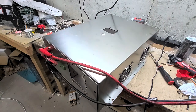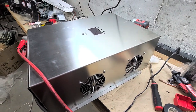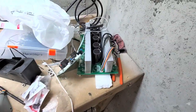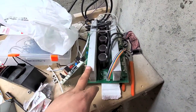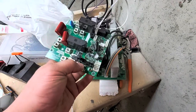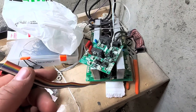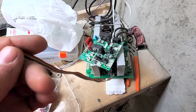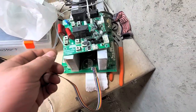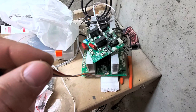My 12K is finally done. Again, this is a prototype, but it's finally done. As you guys know, I had to replace the main board. This is the original main board — there's something faulty with it, and we don't know if that's what caused the control board to fail. The new main board I installed is actually out of a version 9 Power Jack 15,000-watt unit. I also added an extra cap — you can see I took one cap off this board and added it to the other, because we want six caps on our inverters.